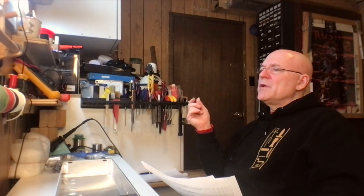One thing I will mention is, as I said in my unboxing, I bought the Triwatt overdrive relay board so I can foot switch the overdrive in and out. There are two versions of the relay set up for the overdrive, and one needs a separate transformer and eyelet board to power the relay. The other one takes the power from the heater winding on the main transformer in the amp and does not need that separate little transformer or relay board. I have that second version.